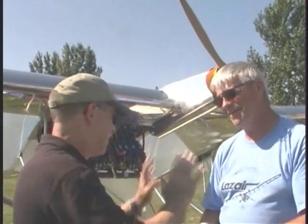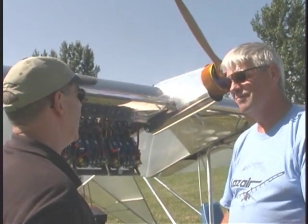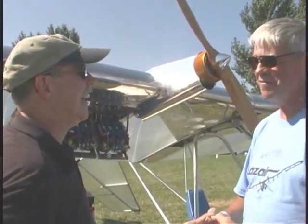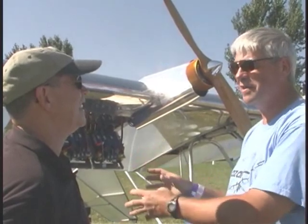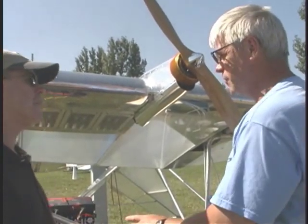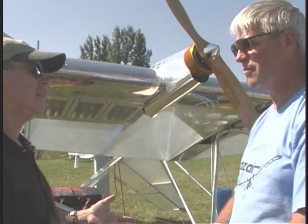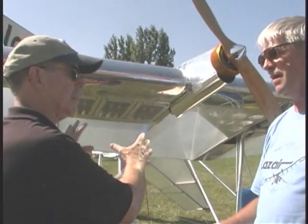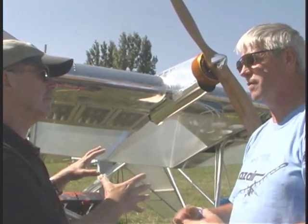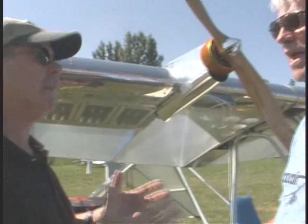So I can take my 95 pounds of batteries out of the airplane and then weigh it for my empty weight. I weighed the aircraft without the floats — that's 200 pounds. The float system is about 70 pounds, so you're about 270 without batteries. That means I only need a 15-pound margin, because you're allowed 254 pounds — or 304 pounds with floats — so I'm way under.